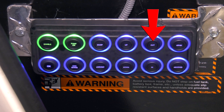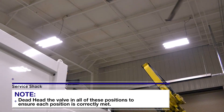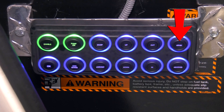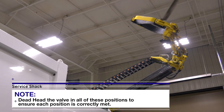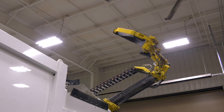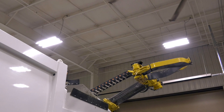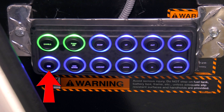Press the up and out push-buttons to place the arm in the fully raised and fully extended position. This sets the max extended position for these cylinders. Press OK and then press OK again to confirm the position. Press the In push-button to retract the arm approximately halfway. This allows for accurate visibility of the grabber beam. Using the undump push-button, place the grabber beam in the level position. This sets the upper value for the grabber beam level position. Press OK, then press OK again to confirm the position.